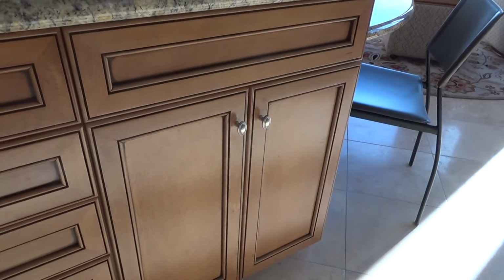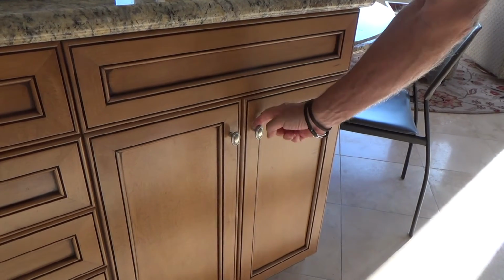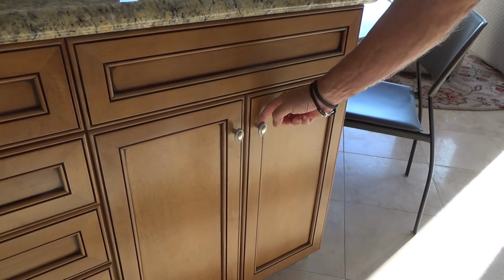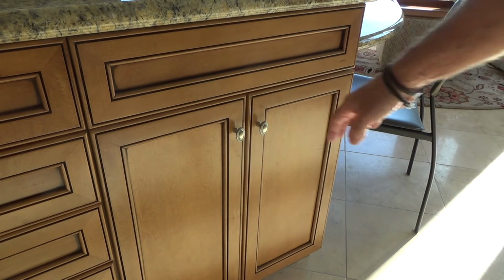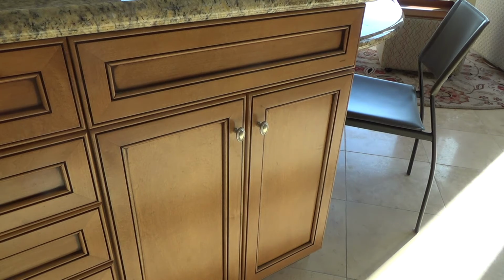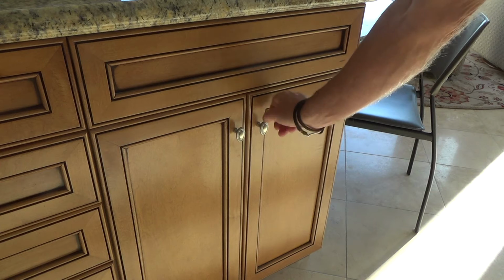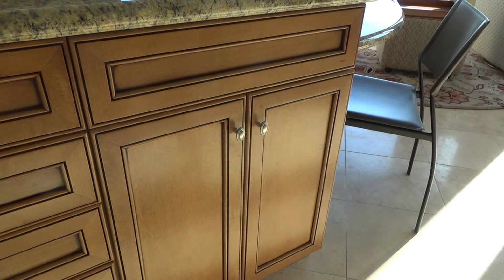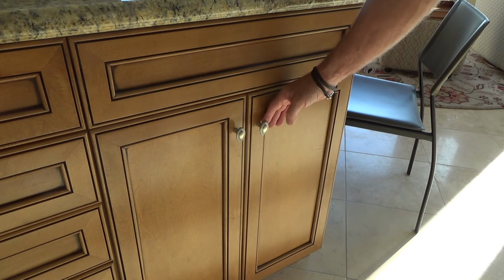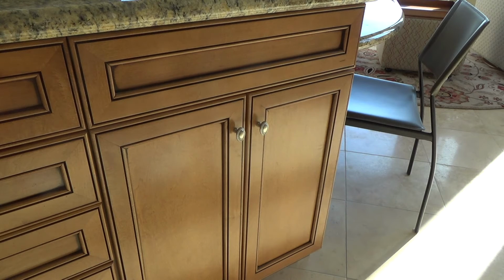Sometimes that happens where you lose a screw, or maybe the screw gets all worn out, and the back side of this, see, the back side of this where the threads are, that could have gotten kind of stripped a little bit, kind of wonky, and so when you had a shorter screw, maybe it didn't tighten up all the way and spun. I've had that happen before too. So then you have to get a longer screw, but then if you don't cut it off exactly right, or if you can't find one at the store exactly right, now you know what you can do.